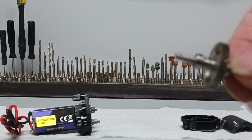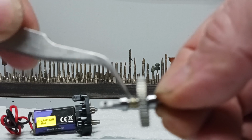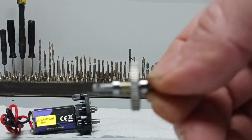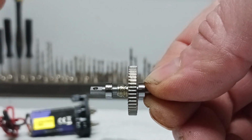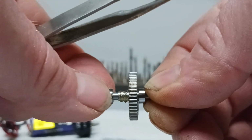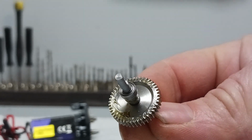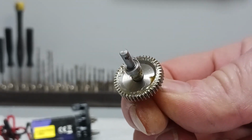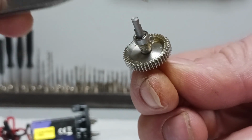Appears to be some weird, maybe it's just grease right here. Yeah, it's just grease. And automatic focusing on the camera, of course, isn't going to show you that, but right in here is where I was looking. There's a little bit of grease right there. The bearing does have a stopping point, so you can't shove the bearing on any further. Let's check the other side of the gear for wear. I'm not seeing anything there. No scratches or indicators. Just some grease. Okay, so that's looking good.